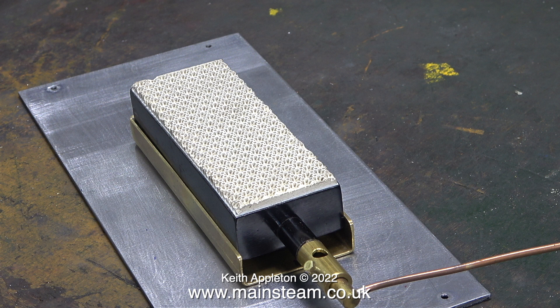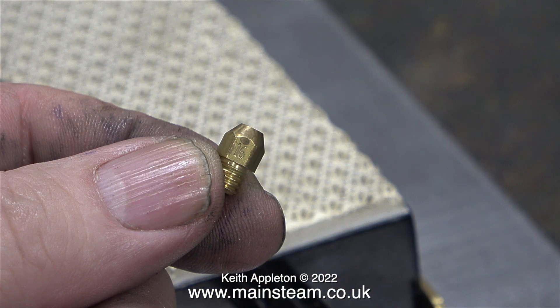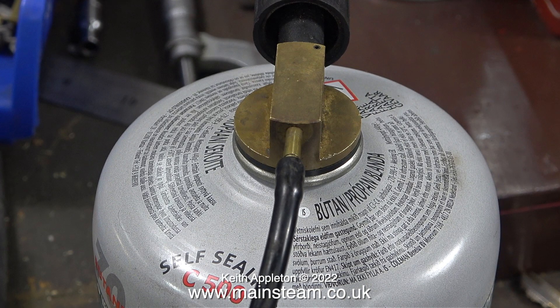What is the solution? Well, immediately you turn off the gas supply, let it cool, then reposition the gas jet in the Venturi tube. This is a number 16 gas jet and it's far too big for this burner. Because this is a tutorial video, I'm going to fit it to this burner and see what happens. To perform this test successfully, especially setting the position of the gas jet, it's best to use a full tank of gas.